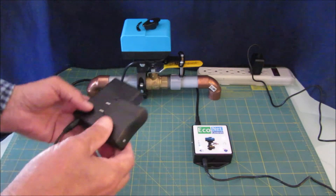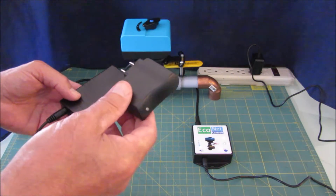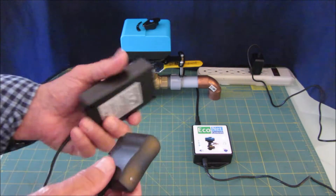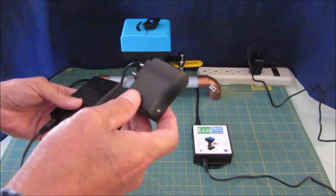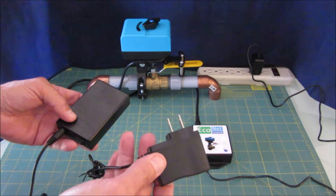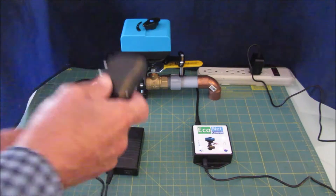Something you should note: the battery backup comes with its own AC adapter, and it has a slightly higher voltage than 12 volts just to properly charge these units. So when you do add the battery backup, you need to make sure you use the AC adapter that comes with it.